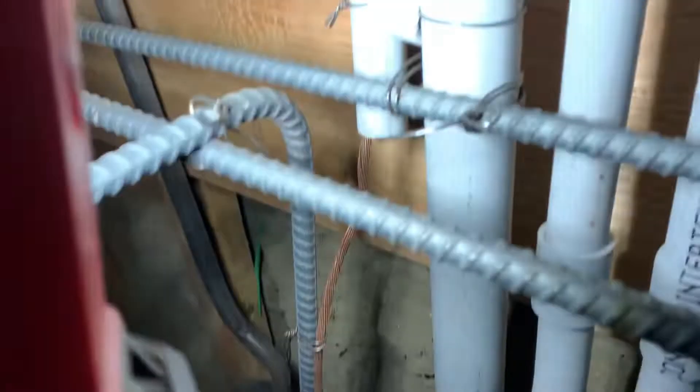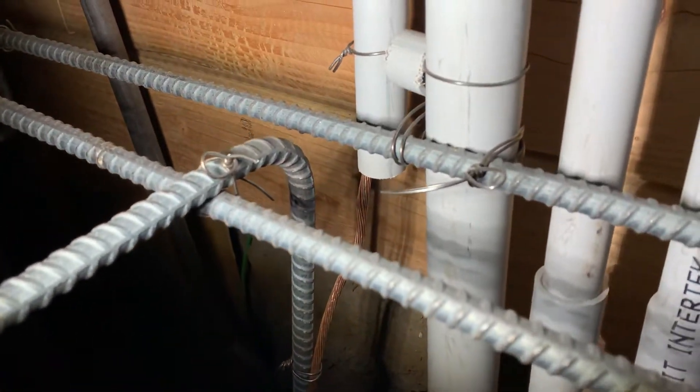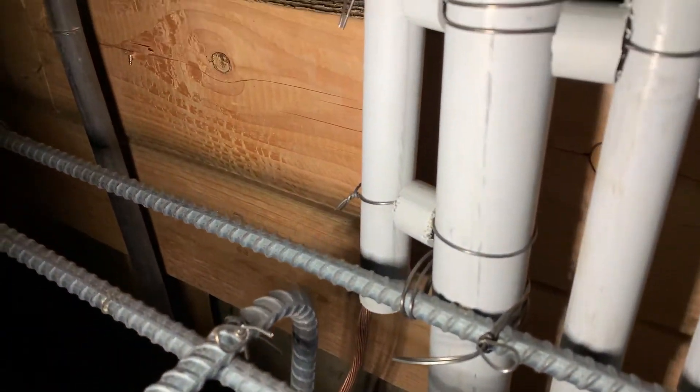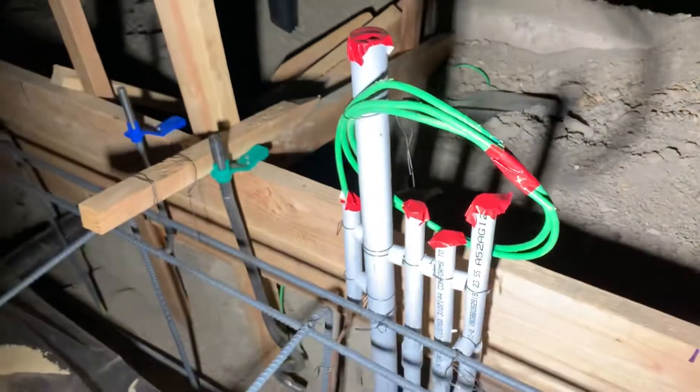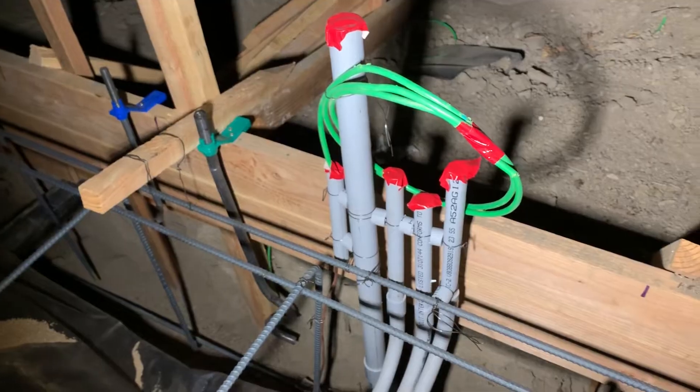Just 90s up, tie wire there again to keep it supported. Comes up and it goes through this PVC sleeve to protect it from physical damage coming through the concrete. The insulation stays intact coming up into this panel. So that's the Ufer ground for this little setup here.